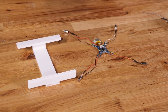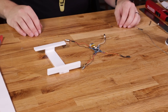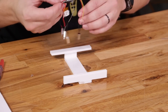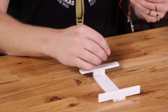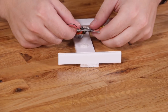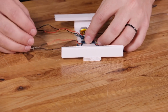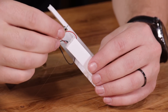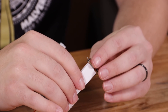After you're done with the extensions on the motors, it's time to add the electronics to the foam board frame — this is when it starts to get fun. During this step, it's important to remember where the front of the drone is and where the front of the frame is. Remember that the battery charger port and the switch are on the back of the drone, and the motor arms with the riser is the back of the frame. You want to start by adding a small glob of glue into the center of the frame. Flip out the battery from under the PCB board and lay it as flat as possible on the base plate. Next, add the front motors in a vertical position with a small amount of hot glue, making sure the top of the motor case is lined up with the foam so the prop has enough clearance to spin without hitting the foam.